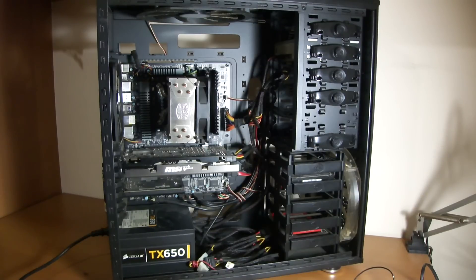There are many reasons to do that. For example, your computer didn't power on when pressing the power button and you want to see if the power button is broken. Another reason is to test your motherboard or an external hardware build works fine before putting it inside the PC case.